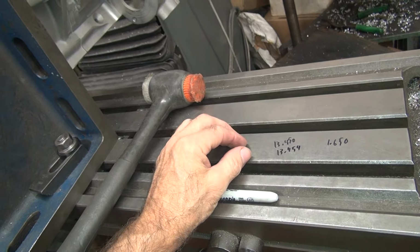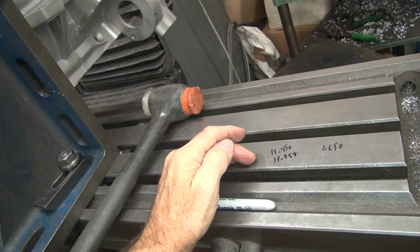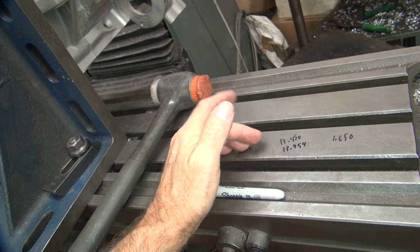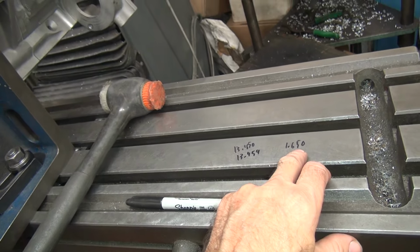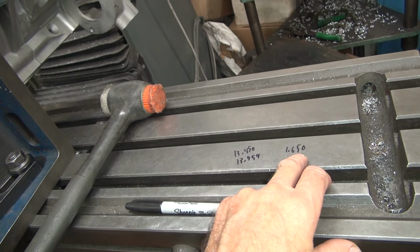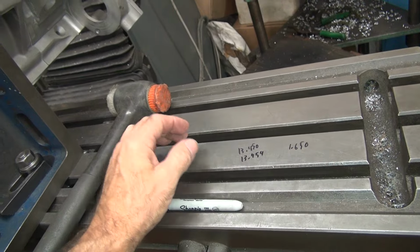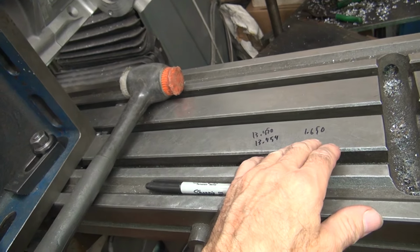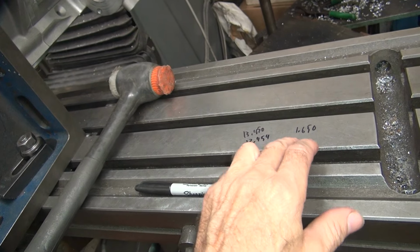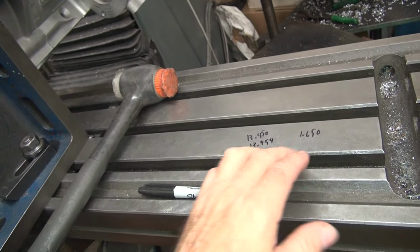All I know is between a knuckle frame and a pan frame, you have a spacer that goes in there. As I recall, when I looked at the number up on the V-twin, that spacer was 300 thou thick. So if we were at 1.650 here, that'd be 370 difference, which is close to 3/8, 375. And I've seen that number used a lot also. So we're kind of in between those two numbers slightly, but we're closer to that number than the 300 number.